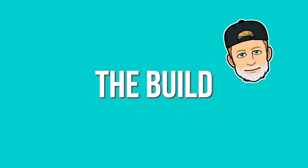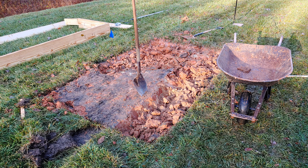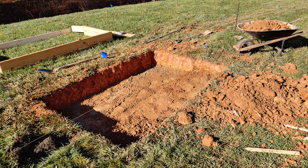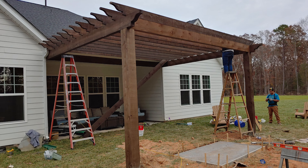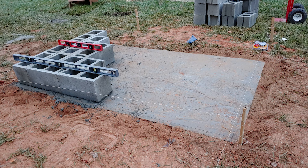So the first thing we need to do is dig out the area for the footing for the fireplace. Our ground here in North Carolina is mostly clay, so that took me a long time with just a shovel and a wheelbarrow. Here's the framework for the box for the concrete, and my wife is in there tying up rebar. This thing's about 12 inches deep in the backside and about eight inches deep on the front side. I rented a concrete mixer from Home Depot and it took 34 sixty-pound bags of concrete to fill that space. At the same time, these guys were installing our pergola off the back of the house, so we had to marry up the front and make sure we were exactly parallel with their work. It was pretty precise — I was within about three inches of where the top of the pergola was going to be.